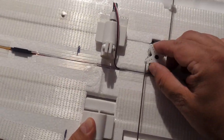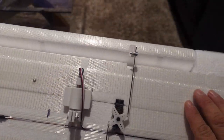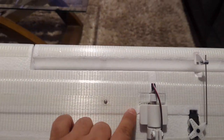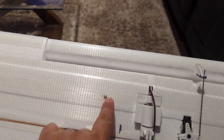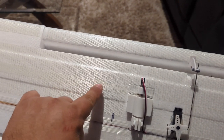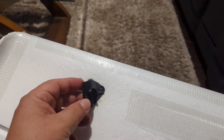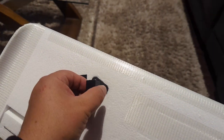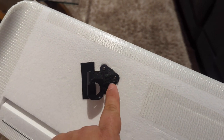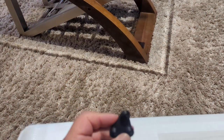I'd rather have a more secure connection. Extreme tape is everywhere — I put covers for the spars. There are two spars here and the main spar on this side. I put a little servo horn screw just to indicate the CG — it's just slightly behind the main spar. You can put it on the spar for the maiden and then just behind the spar for normal use. Here's the aileron servo, and I inserted a couple of hard-point attachments for a RunCam Thumb Pro.